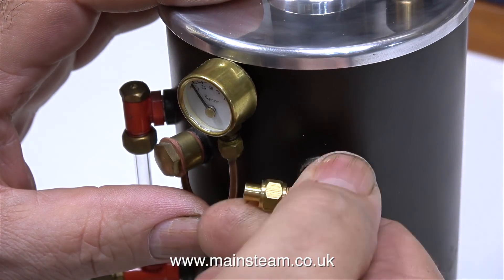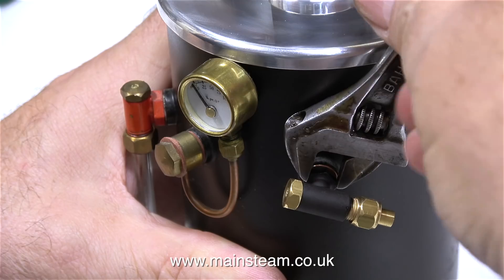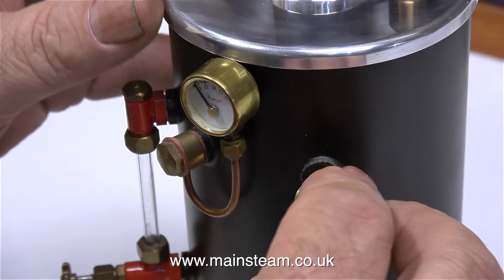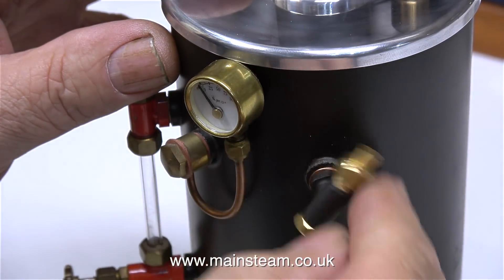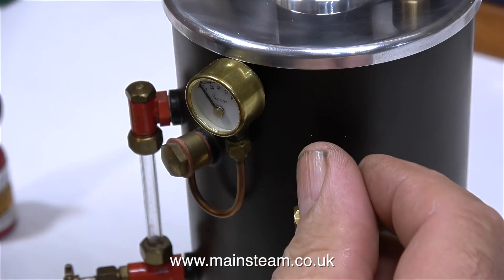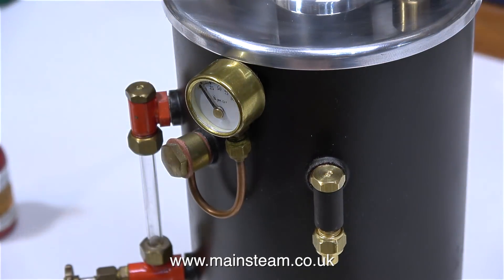I'm trying the clack valve in position with just one washer in place — it needs to end up in a vertical position, and this is not quite vertical enough. A word of caution: never over-tighten fittings on boilers because the fittings are only made out of brass and it's not the strongest metal out there. The solution is either to use a crushable copper washer, or the way I do it, use a shim washer. I'm using another washer which is quite thin and it gets it nearly to the right place. So all I need to do now is apply some Loctite 542 and then screw the fitting into the boiler bush. Be very careful with Loctite 542 — you do not want to spill any of it on any of the paintwork because Loctite 542 removes paint very well. I'm tightening the part into its final position using firm pressure but being gentle at the same time.